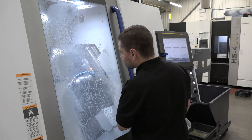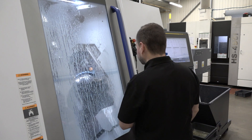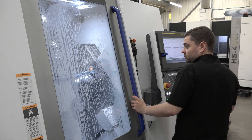I just want to jump back quickly — you talked about having birds nesting before. So how does this machine help you avoid that problem? We have the LFV technology on this machine, which means we can break the stringy swarf up, and that stops the bird nesting from happening in the first place. So we can leave the machine running for a longer period of time overnight.